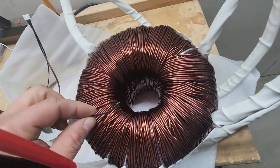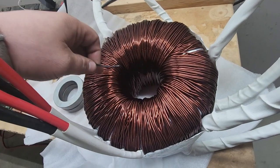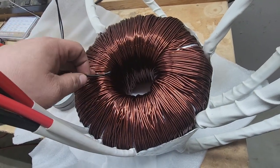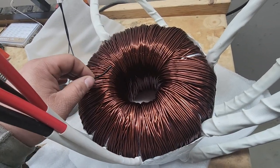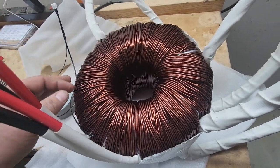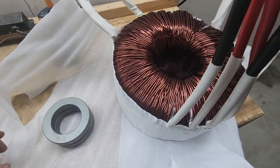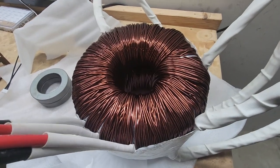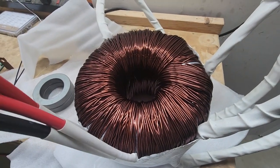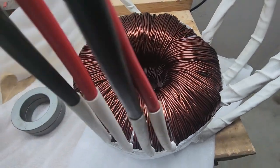Now, I can't stick one of these into the transformer core and touch that. That would kind of be ideal, seeing where your core is at, but that's obviously not possible. I have not had any issues with transformers melting down. We have our shutoff set at 179, 180 Fahrenheit, and I have yet to have a transformer that has melted down at those temperatures. So this seems to work.